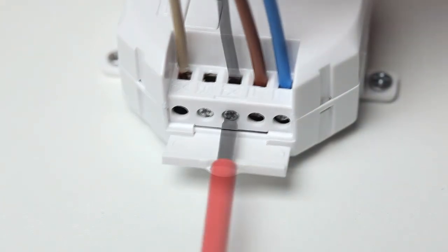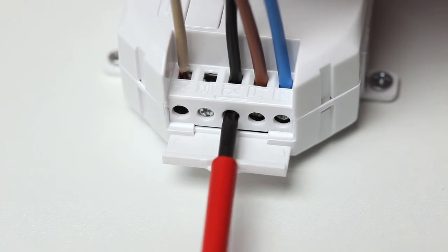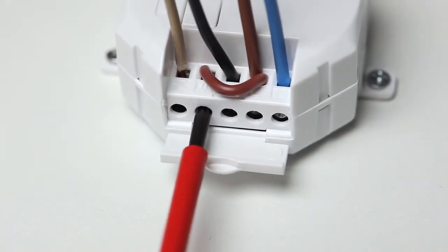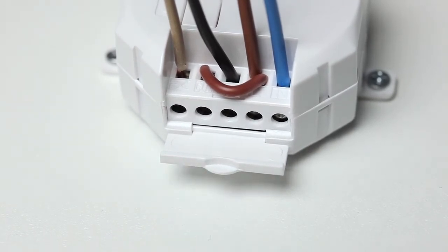Connect the open and closed circuits to control the motor. If the motor is mains powered, you need to link the L terminal to the common terminal on the relay output side. The feed can be fed directly to the controlled motor. If the controlled equipment is low voltage or non-mains, connect the relay output terminals simply to switch on the power directly to the equipment.